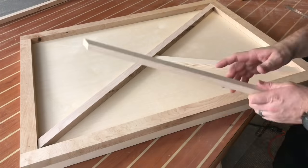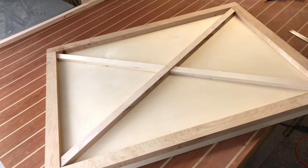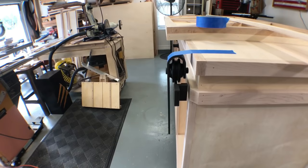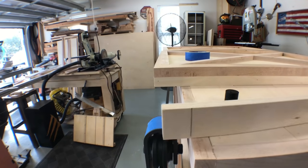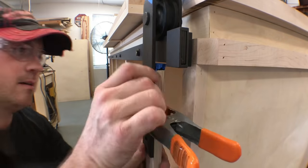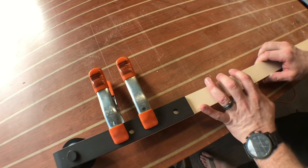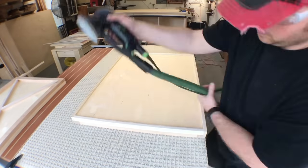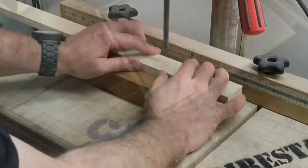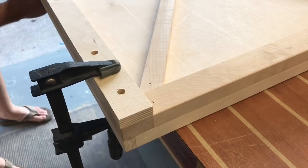I'm cutting them snugly so they fit perfectly. At this point I've taken some blue tape and mounted temporarily one of those brackets to the rail. I'm making myself a template here that's going to give me a guide of exactly where to put the door lock and the holes that reference into the door through those hinges. That piece of blue tape at the top of this template is the door lock. With the template still attached to the door rollers, I go ahead and mark out my holes to drill. I decided to sand the door up first before attaching the rollers. I drill the holes according to the guide and attach a scrap piece to the back of the door — this prevents any blowout or tearout once the brad point bit goes through the template into the door.